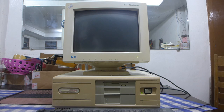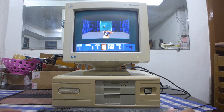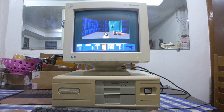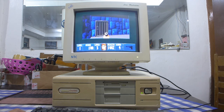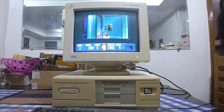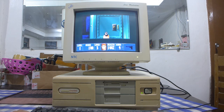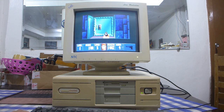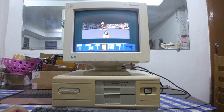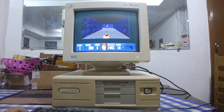Yeah, this is the first time I've encountered a VGA card that's incredibly fuzzy with the palette changes. It reminds me of CGA cards, but I've never seen the fuzz of CGA cards in person. What's funny is that another VGA clone card that was in my uncle's 386SX doesn't have this problem. That one's also an early single chip VGA solution that also has a BIOS where it configures the video registers to have a massive border. And yeah, we now have a working deskpro, or rather, I have a working deskpro.